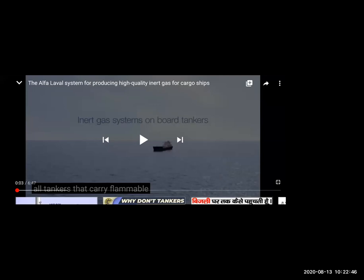Yeah, there is no other way. You have the purge pipe and you can open all other openings also, like the tank dome, depending on your purpose. Pull it out from the purge pipe because it will not come directly onto the human leg level. But sometimes after some time of ventilation, once the gas is below LEL, it's not dangerous. You can open all other openings and gas freeing will be better.